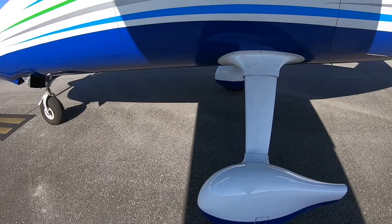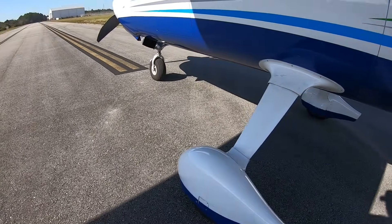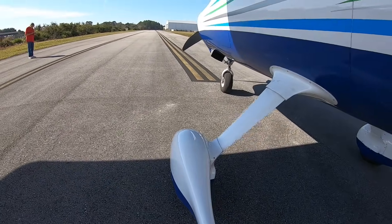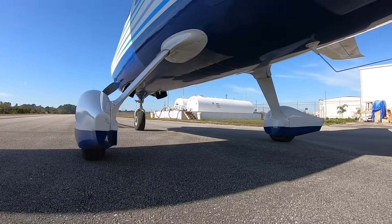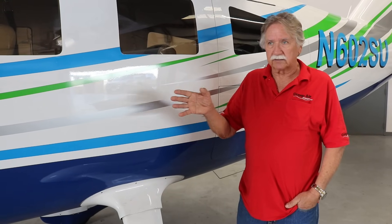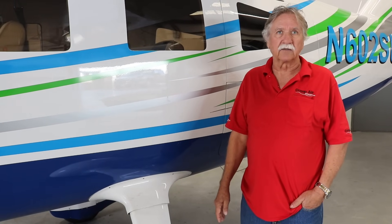What is the gear made out of, both mains and nose? The main gear is a solid piece of 7075-T7 aluminum that goes from one end to the other — there's no big bulkhead that has to take the loads from the gear, so it's easier to do it that way. The nose gear is just an air-over-oleo normal strut. It's a good hardy gear system for landing anywhere you want to go.